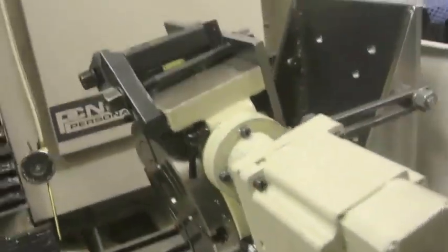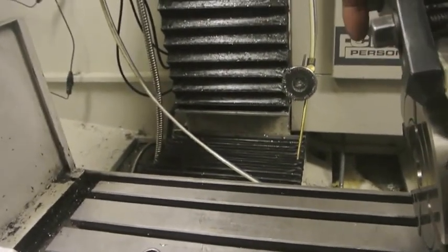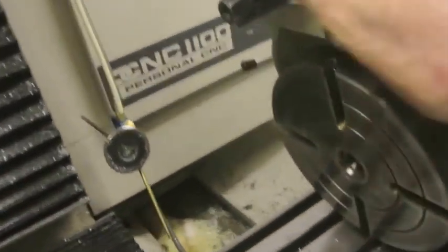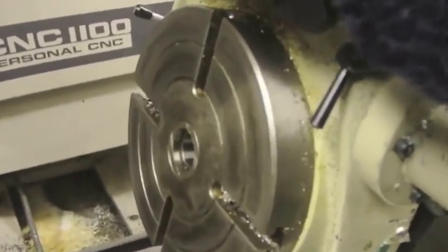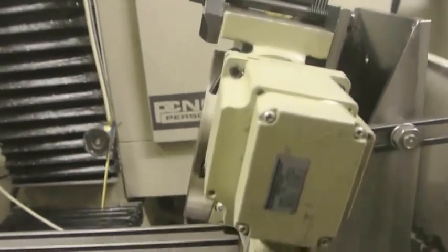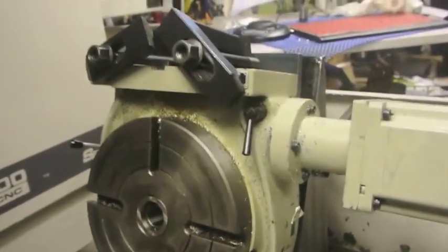The reason I made it is I've got a job which I need to drill down at an angle - the holes are in it at an angle - and the only way I can think of doing it is putting it on a table that I can tilt. As you can see it's quite heavy, but it tilts back up easily, and if I just nip up one of these bolts before it drops - there you can see it's now tilted back at about 15 degrees, maybe more.